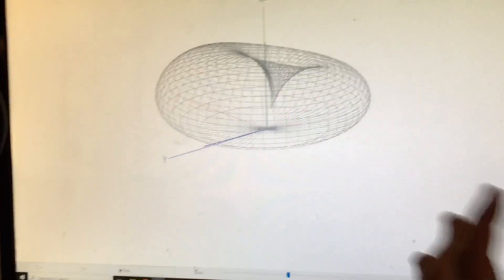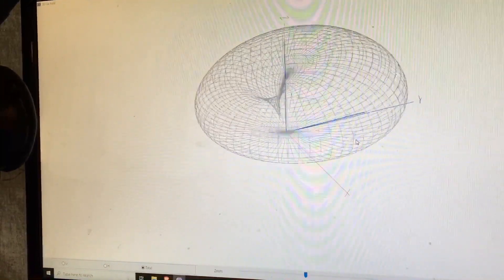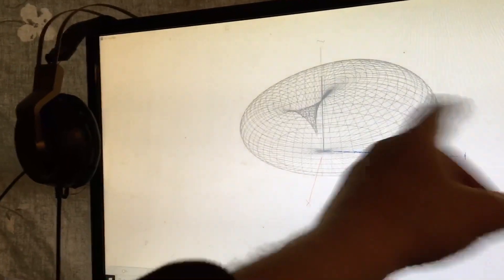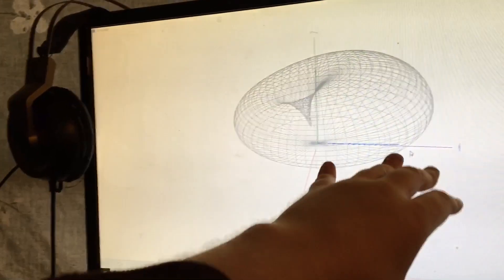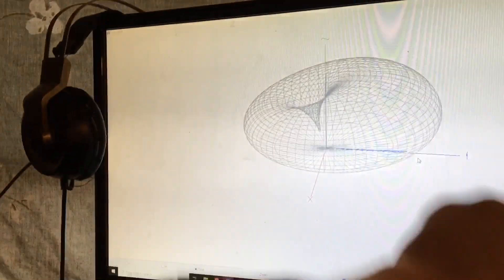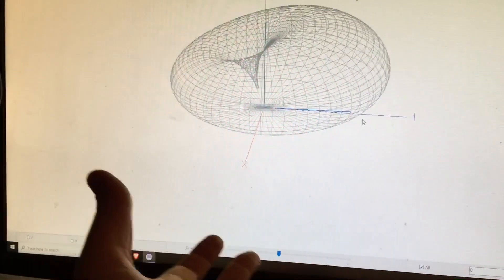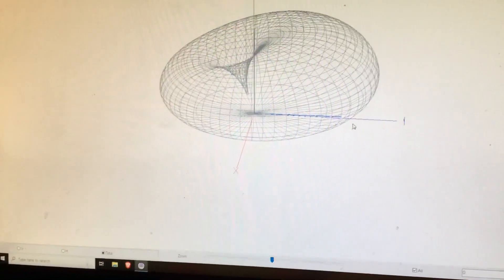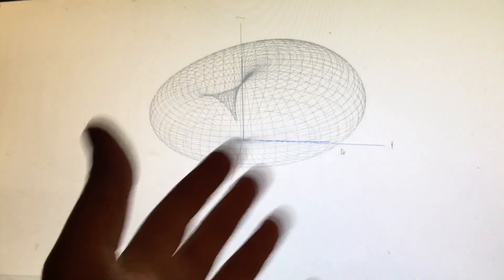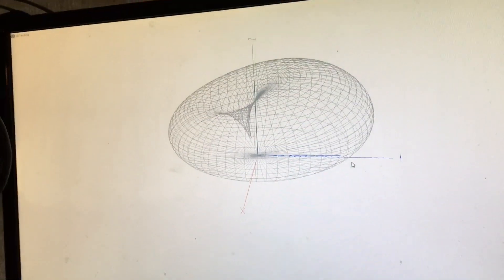You do get some gain in this direction. This is three-dimensional — this is the antenna radiation pattern. You can see it does have a slight front-to-back ratio difference: 1.44 dBi. So it doesn't matter too much which side you talk off of, but you will get some gain in whichever direction is facing the 90-degree angle. I went ahead and modeled this over real ground — I didn't measure the Siemens per meter of my soil for conductance or anything — I just modeled it as real ground instead of free space.